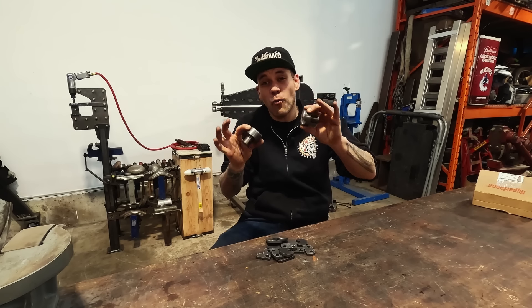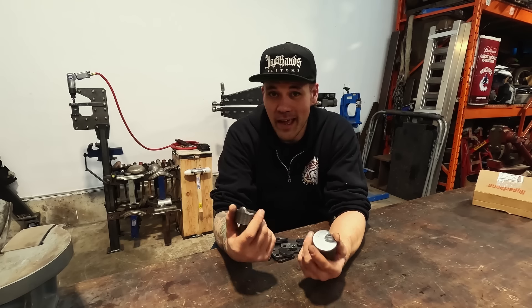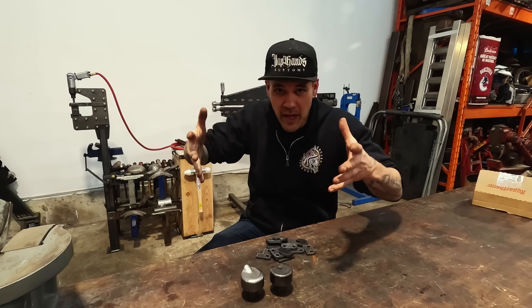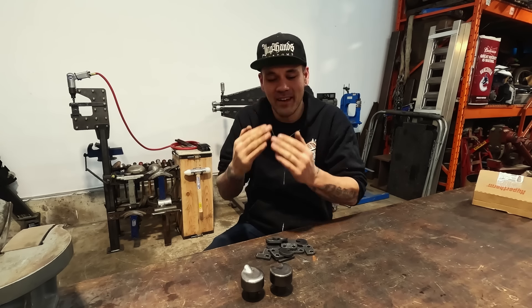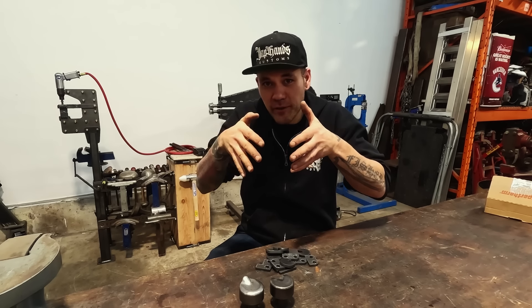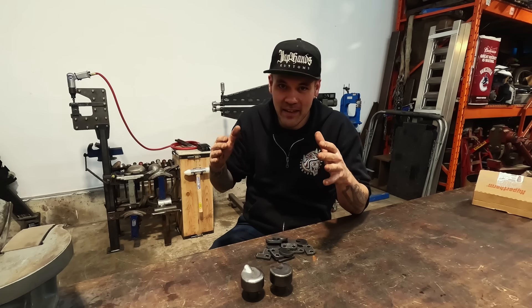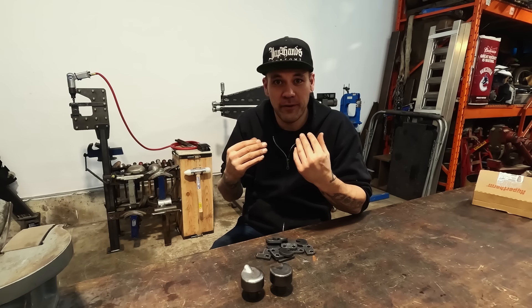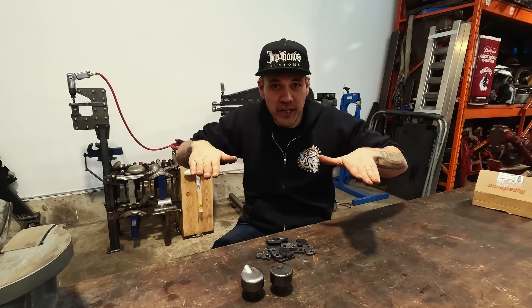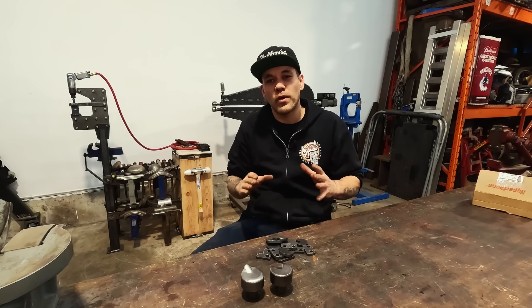Let's talk about thumbnail shrinking dies. What they are is basically doing a tuck. You've seen me with that mother tucker hammer — how I smoke it into that bowl and it pops up a tuck. That wrinkle in the metal that you pop up is the material that gets pushed together to shrink. You've got to think about sheet metal like it's clay — it does actually get pushed together and physically gets thicker.